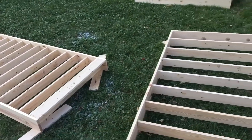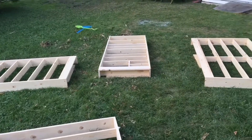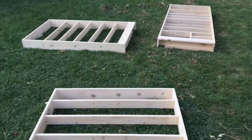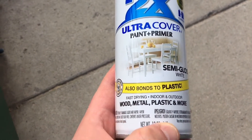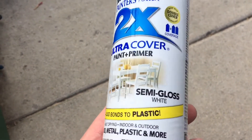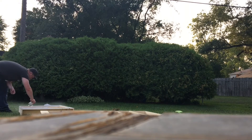Here are my finished shelves — they're all separate pieces so that I can get them in and out of the basement easily. For anyone that's interested, I used one-by-six boards around the frame, about three dollars per eight-foot board, and for the shelving itself I used one-by-four boards, about a dollar seventy. To paint them I used Rust-Oleum paint primer, about three dollars a can — I went through about a dozen of them. It did add some cost to the project, but you could totally skip this step as the natural wood look works just fine as well.